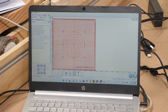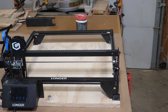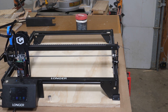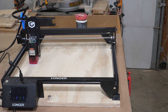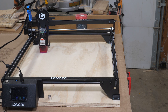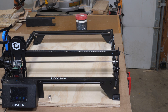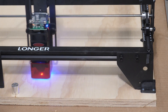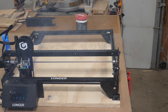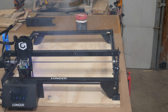There are no limits on this machine, so I want to make sure it doesn't bang into the stops. I'll bring it over to the front-left corner and frame this. I have my speed set pretty slow because I don't want it ramming into something if it goes to extremes. I need to move some of my cords out of the way. It didn't go ramming into anything, so I'll get this started and do the engraving. I've got to open the door because this is going to make a whole ton of smoke. Projected time is about an hour.